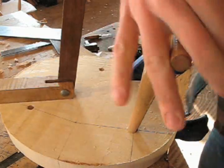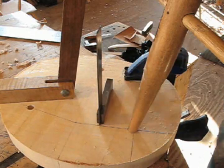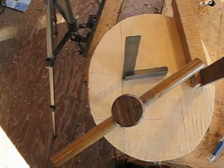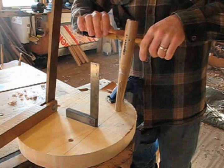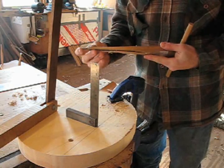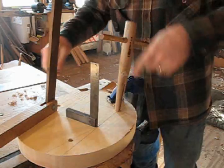It's starting to look much better now. I'll keep taking a few turns, and now it's time to check with the square against the sight line. I put the square right on the line and walk across until that square is perfectly in line, then I look down and see where the center of my reamer is. You can see it's off to the left of the line — that tells me I need to ream a little bit more to the right. I check again and it looks like I'm making the correction. Be careful, that's a sharp blade. It's also a good idea to start using the leg in there to check how things are going.